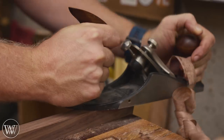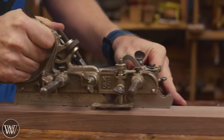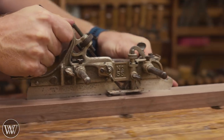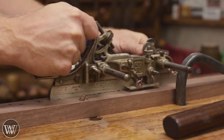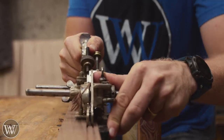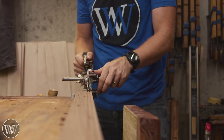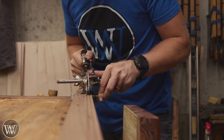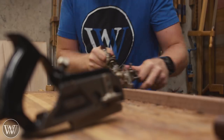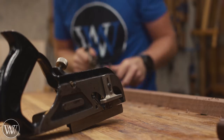Walnut is such a fantastic wood to work with. On this frame I'm gonna make a couple different beads on one side and then a 45-degree chamfer on the other. To create the beads I'm gonna use my Stanley number 55 — this could also be done with a 45 or a beading plane, but this one has a double bead iron so I can put two beads right along the side, setting it up so that the last bead rounds right over the edge. And I have a new rabbet plane we're gonna be using in a minute.